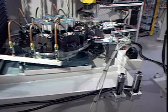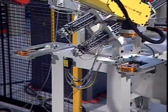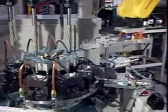Each part from each spindle station on the machine is measured. The robot then changes its tooling, utilizing a specially designed unit to adjust the diametrical size of the diamond tools. The robotic arm makes the required adjustments based on the information calculated through the gauging system's computer.